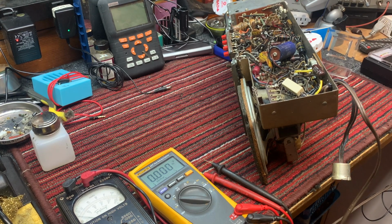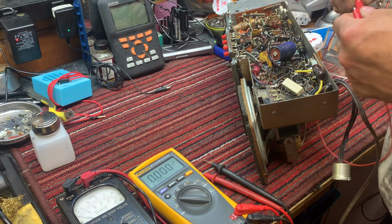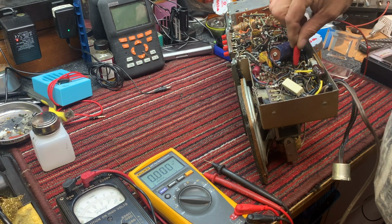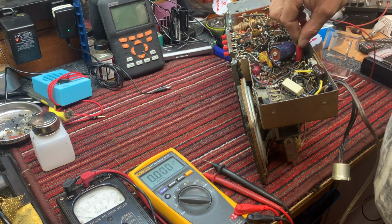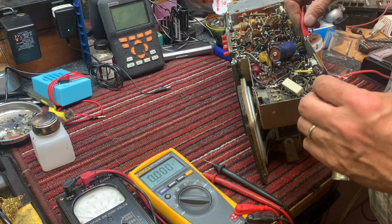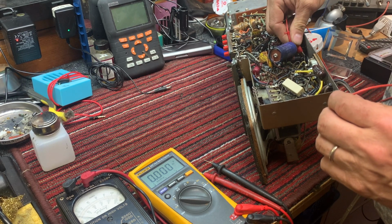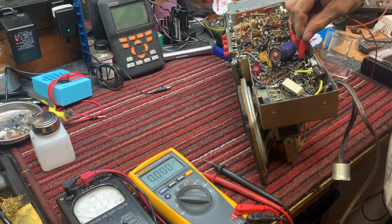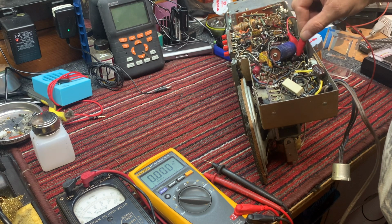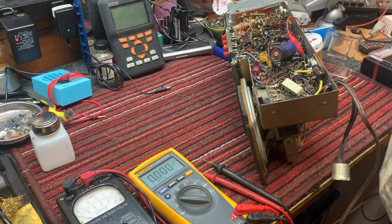I don't test them powered. Okay, the cord is unplugged, and we'll short them to ground. Okay, no spark. No sparky, no malarkey. Okay, there's ground. Let me make sure the chassis may not be ground. There we go. Okay, shorted, shorted, shorted, shorted, shorted. All right.